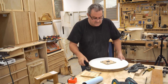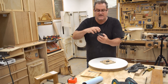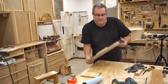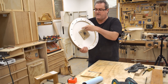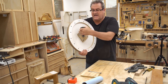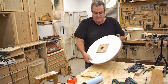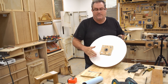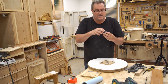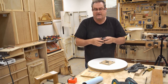And the way I could use this is that I could take a steel plate and actually screw it onto this from the back and then put it through this side over here, and it bolts directly on. That way, any extra sticking out is on this side over here, and I've got lots of space to accommodate that, and it'll be just completely flush on the back here. And I would have to bolt the plate onto this or screw it on, because I'm pretty sure that this is cast iron and I can't weld that. I don't have the stuff to weld that.